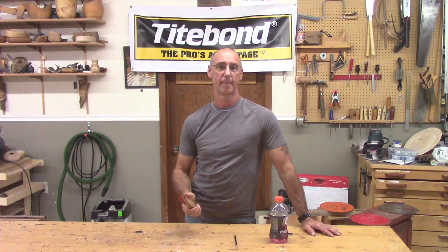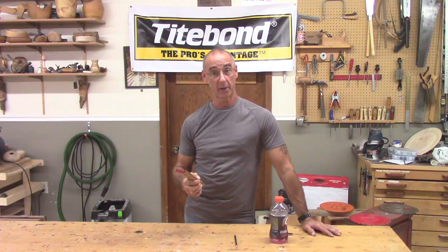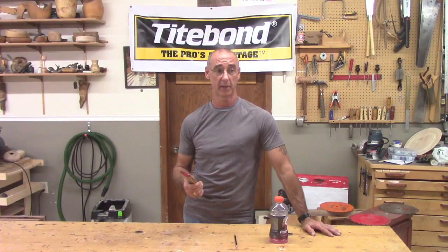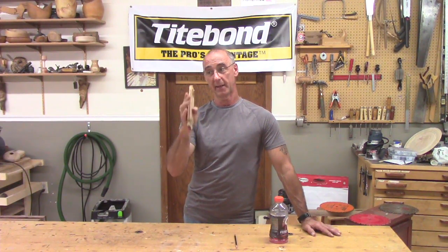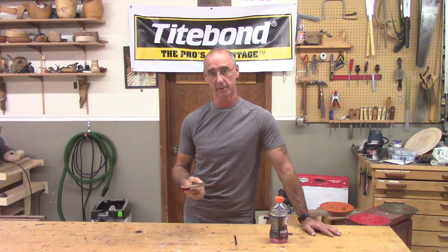Okay. Monty says, is there a chemical that I can apply to the ends of my wood blanks, lathe material ends, to keep them from splitting while they are drying? Yeah. A common commercially available product is called Anchor Seal. And it is designed for sealing end grain. So it'd be a great choice. Latex paint isn't a bad choice. Anything to cap those ends and try to prevent moisture from wicking out the end grain. But Anchor Seal is a commercially made product that's just for that purpose.